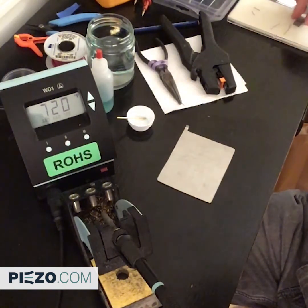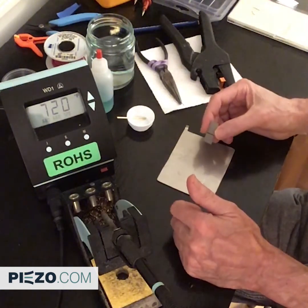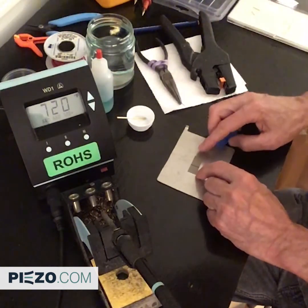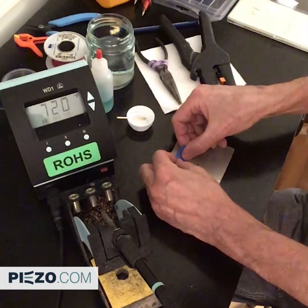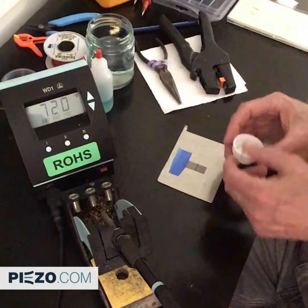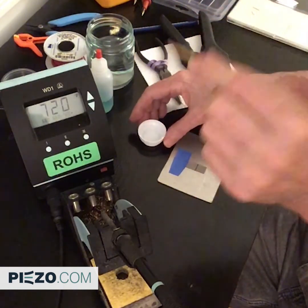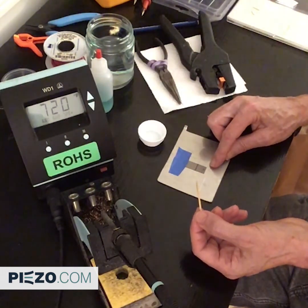Now when you have one of these with the nickel electrode it has to be treated entirely differently. If you were to do what I did before, it would simply not stick — or you might find yourself scrubbing around and pretty soon the electrode is gone. This piece of piezo is very lightweight and it definitely needs to be held in place with a little tape so it doesn't slide. In this case, the nickel electrode is only 1,000 angstroms thick — that's not very thick. You breathe on it, it'll go away. Take the toothpick, just wet the tip, and put a small dot of flux right where you want the joint to be.